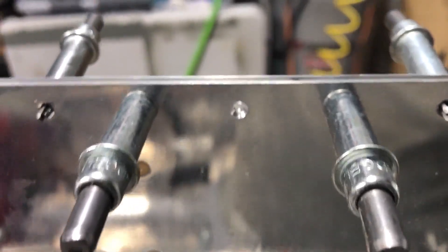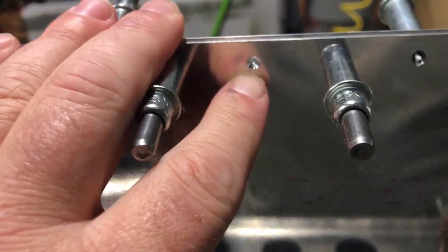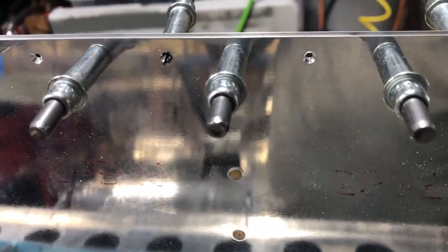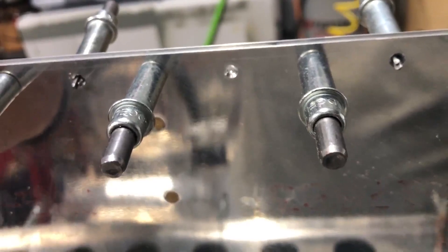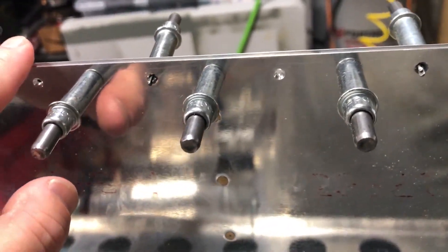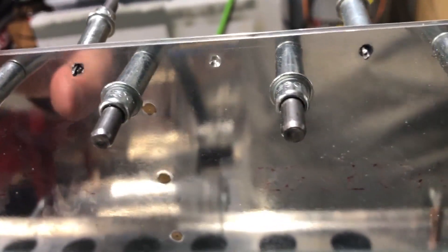I've been back and forth with Vans. There's very little bite once you put a rivet in there. Vans seems to think that it would be okay. The suggestion was to use a 3M special glue that's made for metal - I forget what it's called, it's called like metal bond or something like that - and then like every fifth rivet.